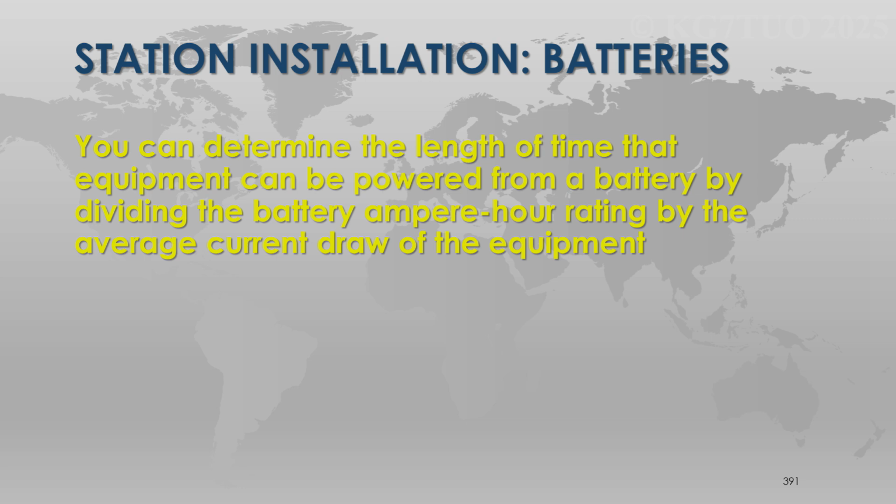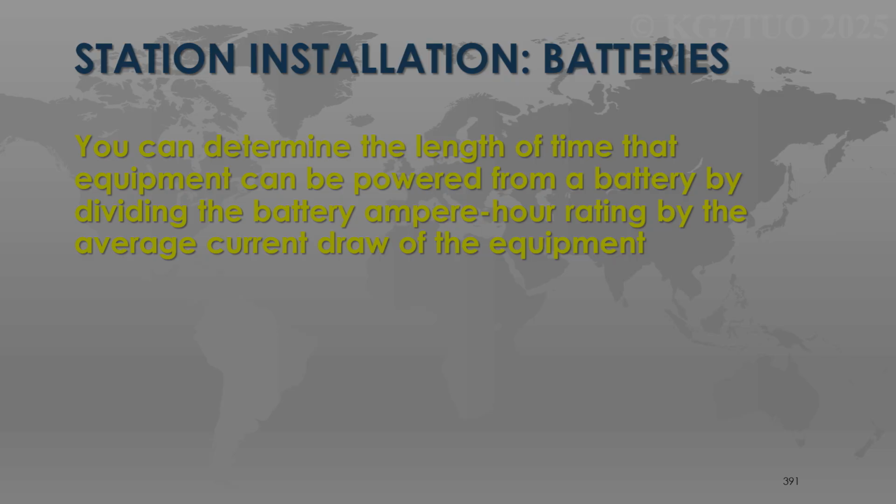And that applies even to that little switching power supply that I suggested for you. That's a 12 volt, 30 amp power supply. Well, it's really not. It's a 360 watt power supply. So you turn it up to 13.8, all of a sudden you're down at 26 amps. It works fine, but you've got to understand it. So, building a bus, everybody's like, whoa, I've got 400 amp hours. I'm like, wow, I only have 400 amp hours. Mine's 10 kilowatts. How much is yours?